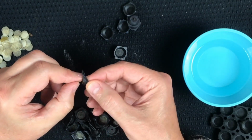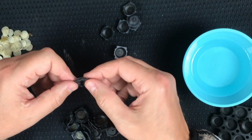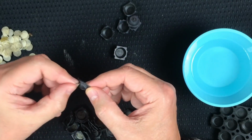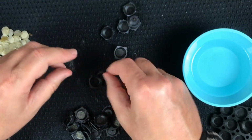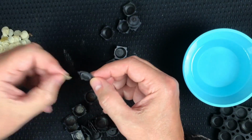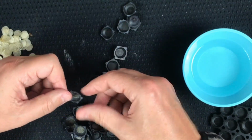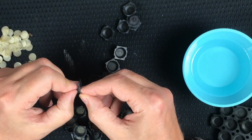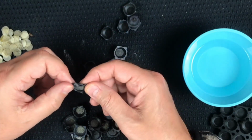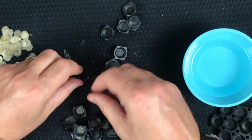Yeah, I should have probed harder when I took this keyboard apart. I thought this was just glue and foam stuck to the rubber dome. That doesn't make sense, so I should have realized it was a plastic disc. I think I tried to peel it off too, and I just didn't catch the right edge. It's obvious now. It's kind of nice to know that the boards that used foam and foil are basically the same for all of them, including this one, as far as the way the foam is used. The only thing I worry about is the thickness of that foam layer. Maybe that varied between keyboard models.